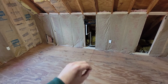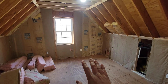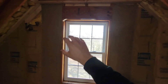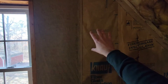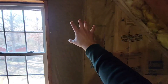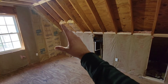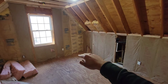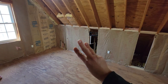Now let's talk about my preferred choice of location for these wall mount air handlers and the options I gave the customer. I've done a lot of projects like this and typically I mount the wall mount air handler on either side of the window, at least six foot high — I'd probably mount it right here. These 12Ks are around 30 to 32 inches so it would probably fit, and that would be about six foot from the floor. The current location is only four foot from the floor. I like mounting higher because I have more distance to blow the air and I'm less likely to hit an obstruction. When I spoke to the customer I gave them three options.